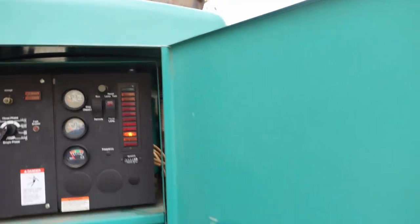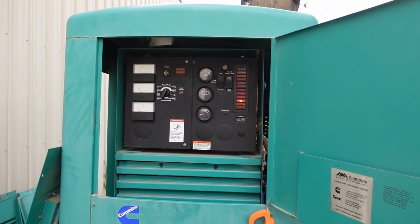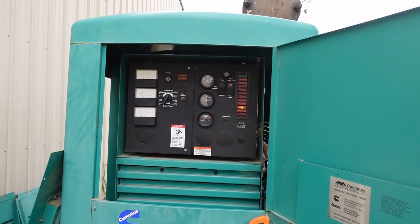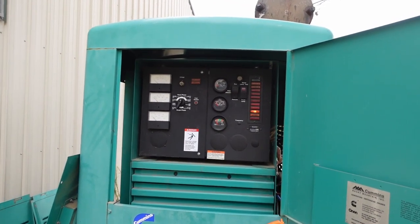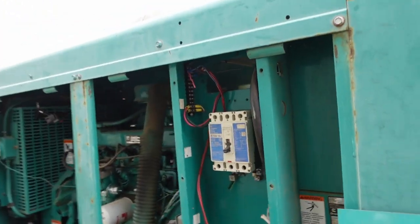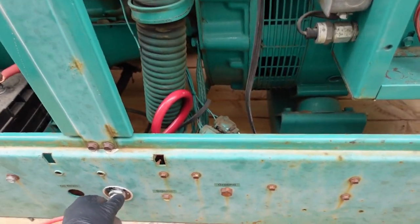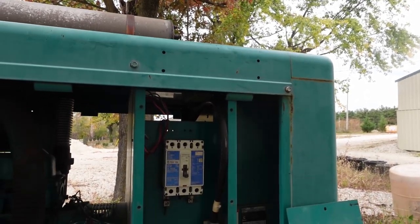Beautiful. So we had 210 volts, which makes me think, as I probably mentioned in that other video, this is wired for 208 Y configuration. Since I'm not gonna be doing backup generator services here, I'm hoping that because the guy I got the machines from was in a commercial shop and 208Y is common in commercial settings now, I'm just gonna keep this as is, and I'm not gonna try to reinvent the wheel here.